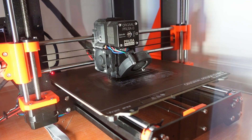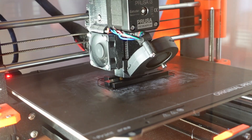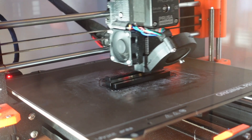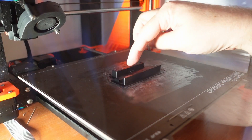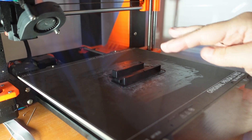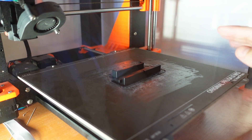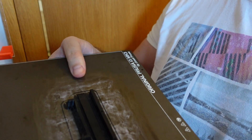This is the second group of objects and it looks okay so far. The progress is good and it will be finished in 15 minutes. Printing finished a few seconds ago — I can see a little bit more stringing but nothing special, and the objects are perfectly straight with no signs of warping. I have to wait until the bed cools down and then flex the bed to remove the objects.